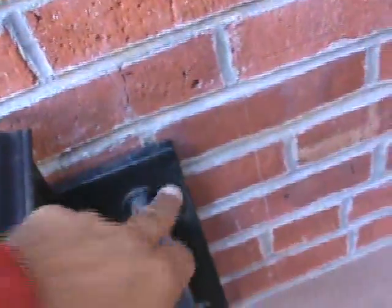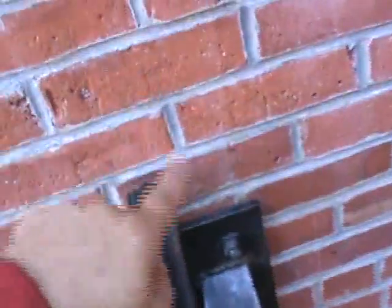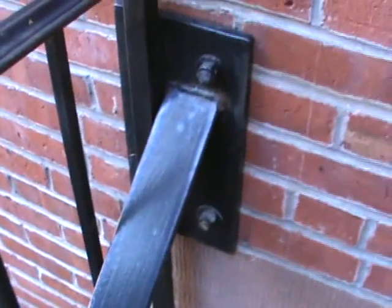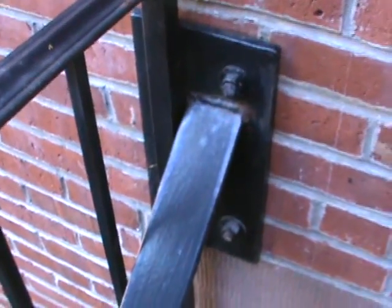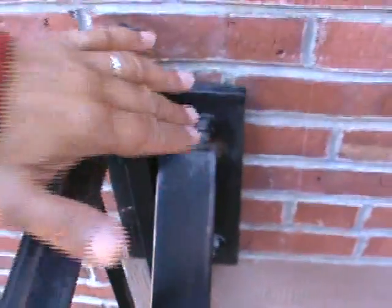Because this is a reverse cantilever bracket, this is supposed to be a 3/4 epoxy bolt into the building. If we have wood behind here or we have a problem, then we have to go in with a plate. So again, we'll discuss this with the city official, but this is not to code or to industry standard. This should have been picked up during the permit process. When the city official walked this job, he would have found this to be not to code.